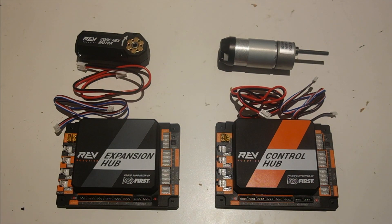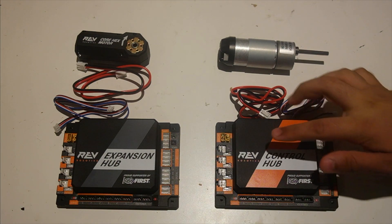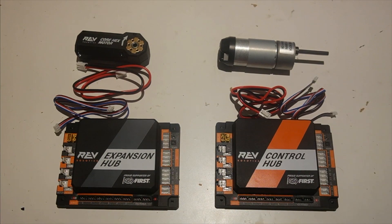This is for a reason. There are two separate wires that go to a motor. The one with two prongs is used for power. The one with four prongs, like a sensor cable, is used for the encoder. The encoder is essentially a rotation sensor for your motor.